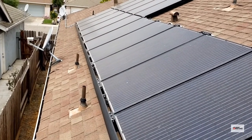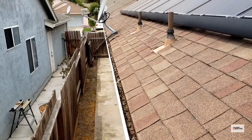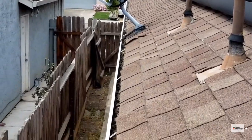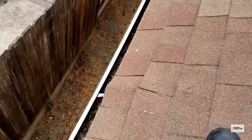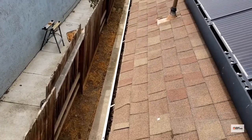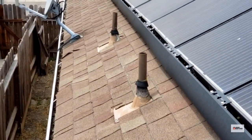Standard composition shingle inspection here, some solar panels. One thing I noticed is the weight of the gutter being full of debris is causing all of the straps to pop upwards, which is peeling open and damaging shingles every so often. We're going to need to get these shingles open and secure those straps and get the shingles replaced, but we're also going to have to recommend they get a good gutter cleaning.